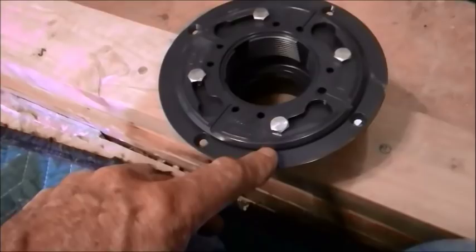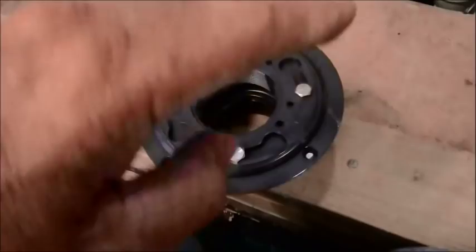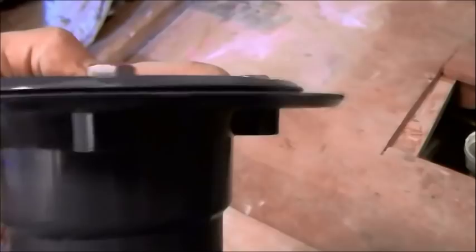Everybody talks about a pre-slope being done and all that stuff, and I'm not even going to debate that issue anymore, because we're waterproofing the entire pan surface now. So to have a pre-slope is a moot and irrelevant issue. But anyway, if we weren't waterproofing and water did get into your pan, look at all the ways of egress that this shower has for water to get out, that this pan, as it were, for water to get out.